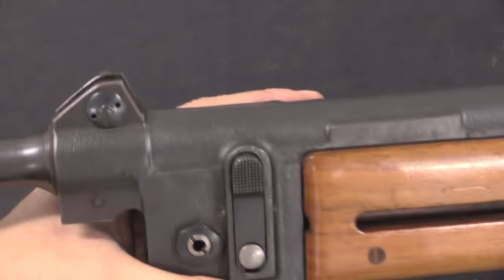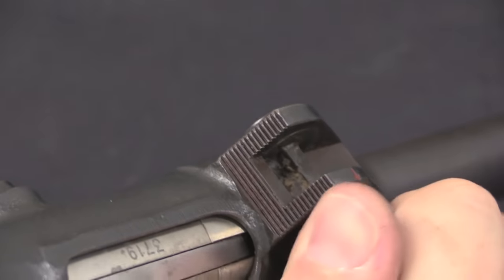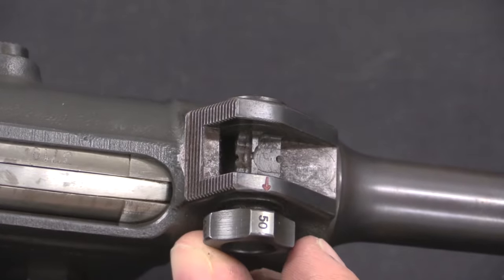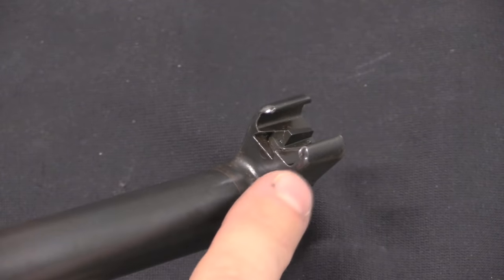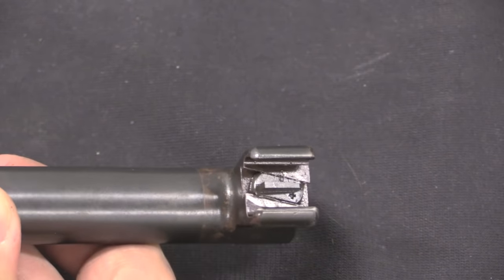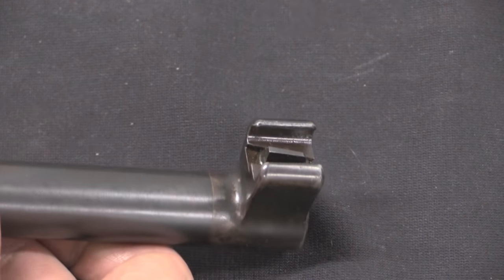This was machined for that style of safety, but it was never actually installed on the MP48 pattern. Instead of a tangent leaf, the sights are now a rotating block of U-notch sights. There's a little arrow that tells us what range we're set to, and they have 50 metre, 100, 200, and 300 metre rear notch options. The front sight is actually even more K31-like than some of the earlier guns — it's got the K31 style of protector wings, and a square front blade mounted in a diagonal dovetail, so you can adjust windage in very slight increments by tapping it forward and backward.